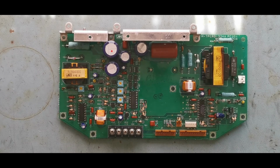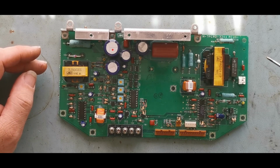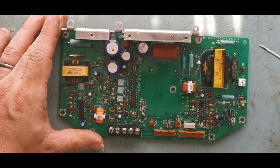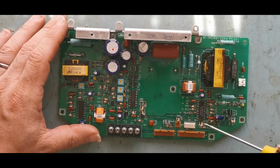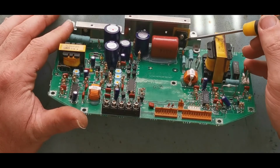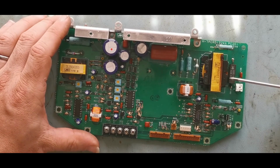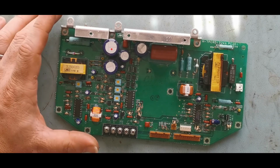Right, so we'll start with this power board. This is literally just a control board that is generating power supplies, so there's not much to it. We have a definite split down here, and what we've got going on here is this large transformer, various passives here. There is a massive driver transistor on there. K1855. Everything in here is marked JRC, which makes me think that potentially this is actually rebadged. It's manufactured for Raytheon, or was.